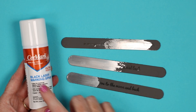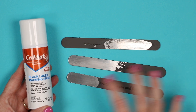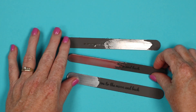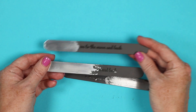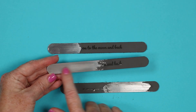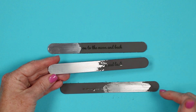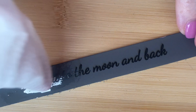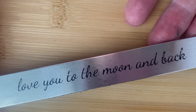For the bonding option, you use a black laser marking spray — just spray it over the metal in a nice even coat, then put the metal in the laser. Here are examples of what happens when it doesn't work: you can see the spray marked onto the paint, but the paint just rubs right off if it doesn't bond to the metal, leaving nothing on the surface. Those three examples were with my low wattage Glowforge Spark. However, when I used the same technique with the XTool S1 20 watt diode laser, I actually got a permanent black marking on the surface.